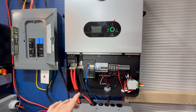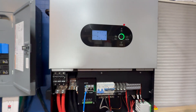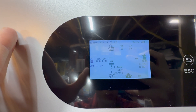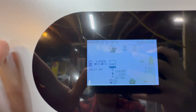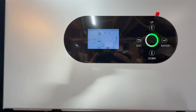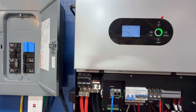We just recently got this connected a few days ago, and now we have the full load test going. We've got roughly 12,000 watts coming out of the batteries and close to 11,500 watts going into the AC. Right now it's 9:08 PM, so there's no PV outside, and we've got roughly close to 12,000 watts coming out. We could run some additional circuits too.